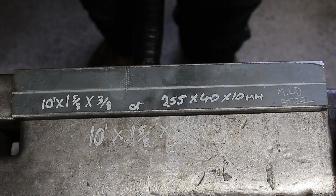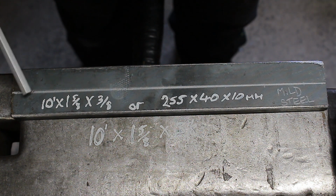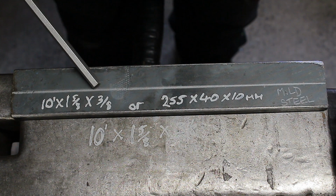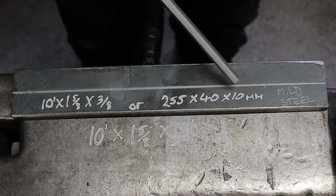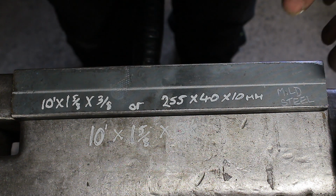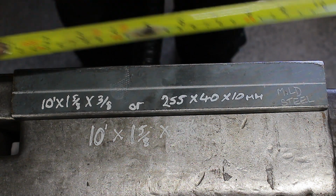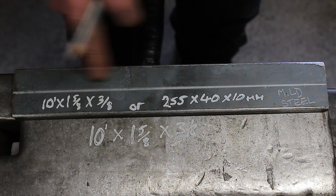So guys, we're going to start with a bit of mild steel flat. It's 10 inches by 1 5/8 by 3/8, or 255mm by 40mm by 10mm. Half inch or 12mm would be a lot better, but because I don't have that, we're going to go with 10mm or 3/8. So what you want to do, mark your centre line,